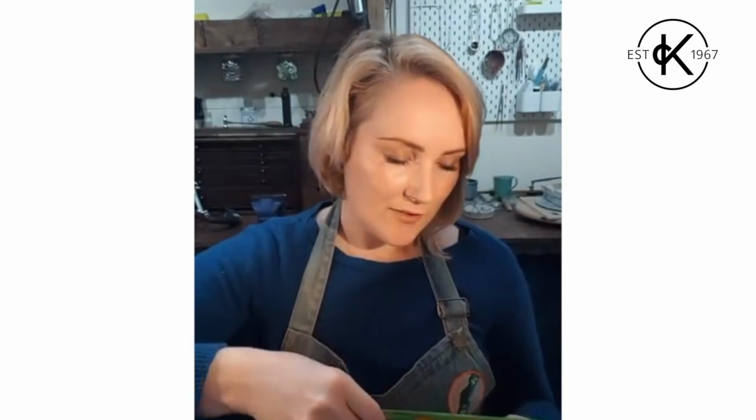And as we said a minute ago, the finer the tip, the better, because if you draw a line with a really chunky pen and you start off cutting on the outside of that line and then you end up cutting on the middle or the inside of that line, that could be a few mil difference. Whereas if you've got a very thin line that you're following, you know exactly where it is you're aiming to cut your work.